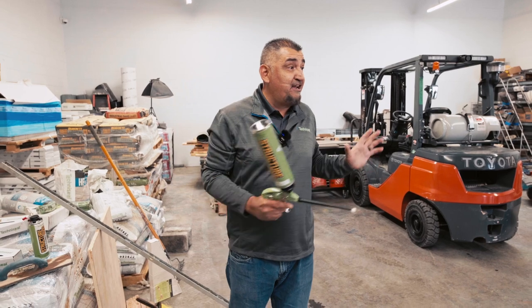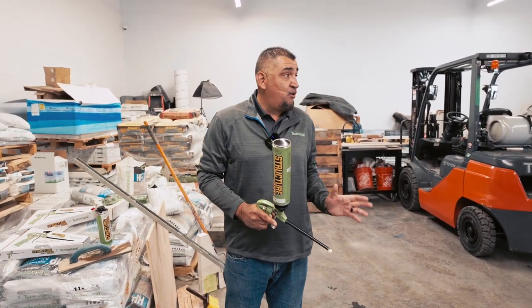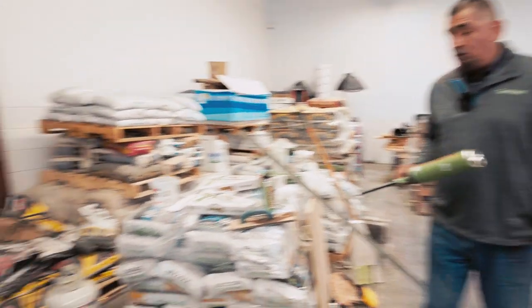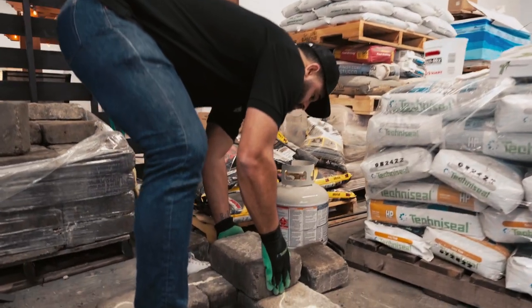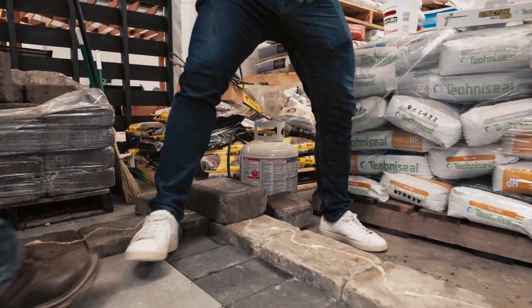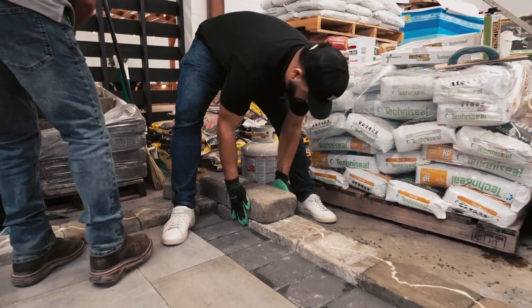You have to understand you can't go too far ahead, because once you start laying these blocks and they dry, they're dry. So go ahead and lay the blocks. See how some of these stones are actually wet? That actually helps accelerate the curing process. Full cure on this is about 24 hours, but it starts setting in about eight minutes.